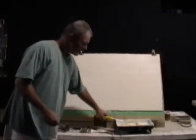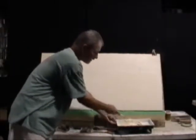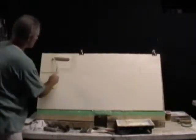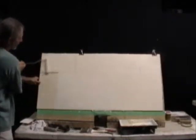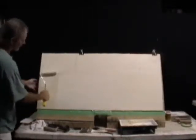As we finish up these last two blocks, you can use other tools besides the trowel to apply the quarry stone as your final coat. Here we're using a six-inch roller and applying the tinted material — it's a little faster method. If you're doing a whole room with these blocks, you may have as many as 200 blocks, so it just speeds up the process a little bit.